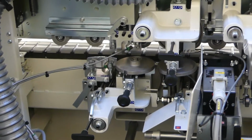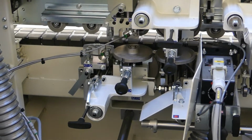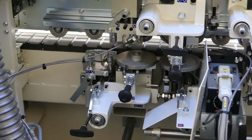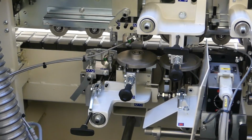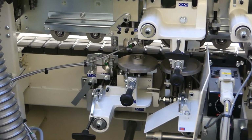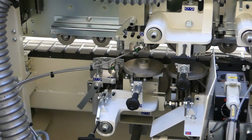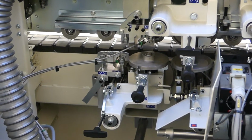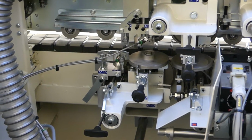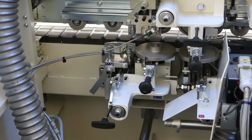Any questions on those units? No, that's all good. Cool. And then the last units we've got down here are glue scraper units. Glue scraper or flat blade units. What they are is a little flat knife which sits top and bottom flush with the board, and they'll take off any excess glue on the board, so you shouldn't have to scrape it afterwards. There shouldn't be any manual scraping. It'll get off the excess glue which is left between the panel and the tape.